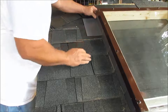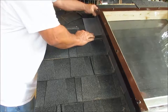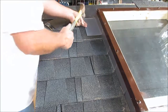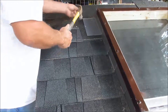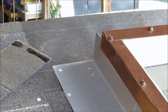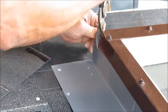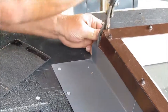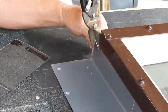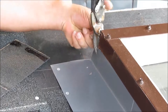Now I'm getting up here to the top piece. I'm going to let my top hang over some up here, and I'm going to nail this right here. Before I lay another shingle, I'm going to go ahead and cut this right here straight down. I might should have cut it before I put it there instead of talking.